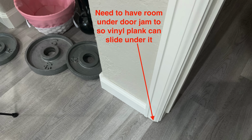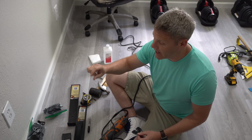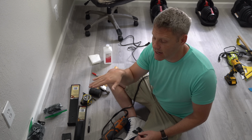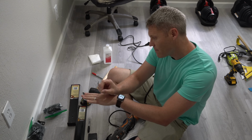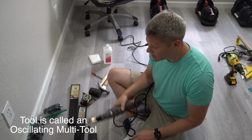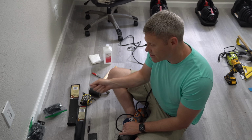However, if you already have tile and you're not gonna remove the tile and you're just gonna put the vinyl plank over it and it's already flush with the tile, you're gonna have to cut out a small piece of your door frame so that you can slide the vinyl plank under there and make it look nice. Put the vinyl down on the door frame, make your mark, or just leave it there if you have a tool and just cut in there so hey, it's gonna slide right underneath. But you could use something as cheap as a little hacksaw. I'll put some links in the description, and it's just gonna take more time.